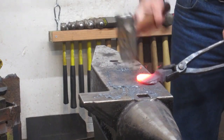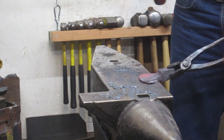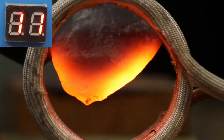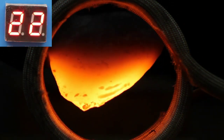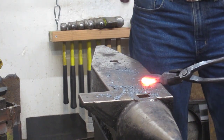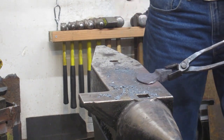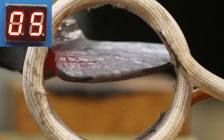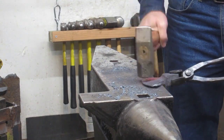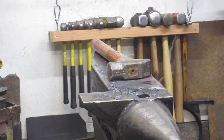At this point it doesn't even fit in the big coil and I'm having to heat it one side at a time. That really isn't much of a drawback, because the anvil draws heat out of this thin metal really fast and the other side would have cooled down anyway. Still doing some peening - about to start switching to the flat face. I've switched to my cross peen hammer for drawing, still using the cross peen, but about to flip it over and do some planishing. We're going to planish everything out until all we need to do is some grinding.